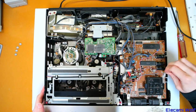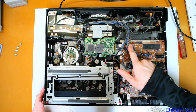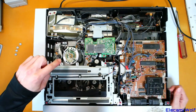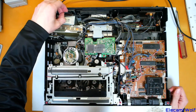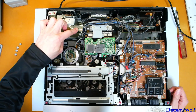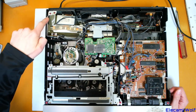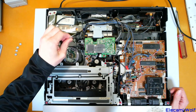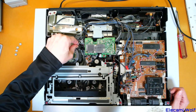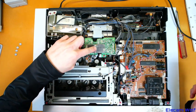You can disconnect them by unplugging that cable there. When replacing timer circuit parts, remove backup cap. Pretty sure I've tried some things in this before. There's no switch mode power supply in this — it's just a transformer. Then there's some rectifiers and things on that board on the transformer, and then there's various regulators around. There's one here on a heatsink around the back. There's a regulator pressed into the video head there, so that will keep the head slightly warm.